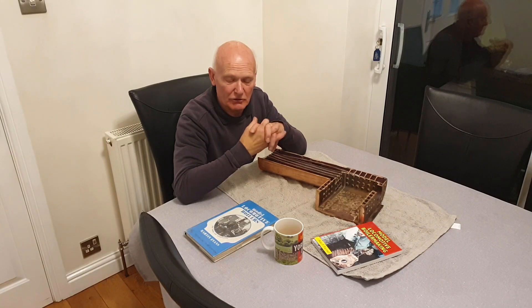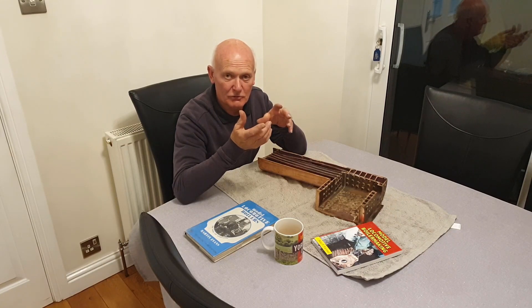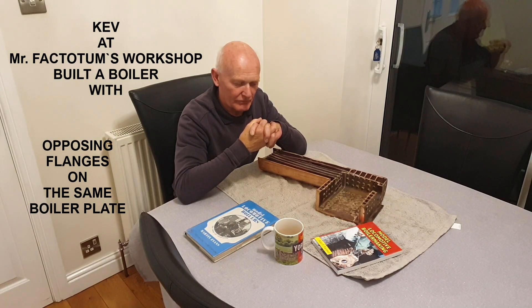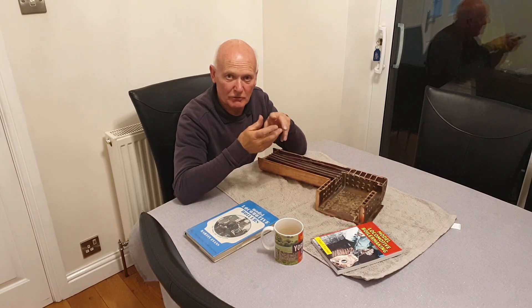You can also catch up with Nigel on the Go Create Hobby Machinist video channel - he's built a five inch gauge boiler for his Lion. So there are quite a few channels and books to look at. I think I'm going to go with Quinn and do mine at about two thousandths of an inch gap, because they've got to have a gap there for the silver solder to flow.